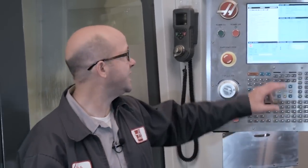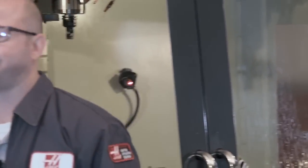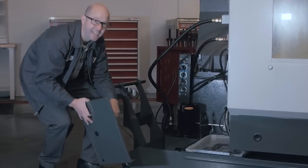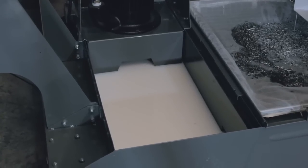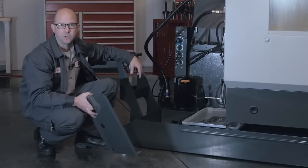So now we've been making parts in our machine and the control is telling us that our coolant level is low — about a half a tank — so it's time to top it back up. The tank is half full, which is the perfect time to fill it back up because it makes estimating easy, and we will be doing some estimating as we mix our coolant.